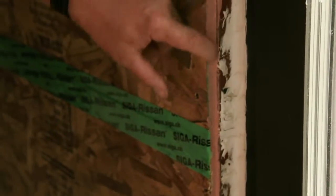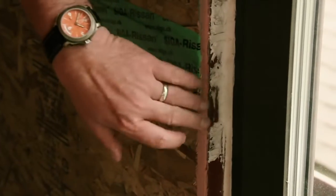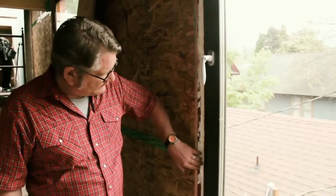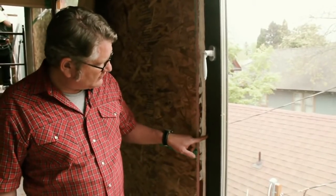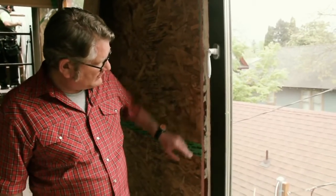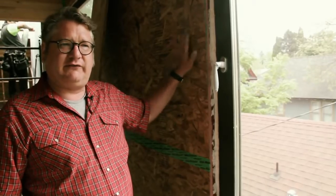The pink stuff spans a structural joint — for instance, the structural joint here between the OSB and the framing — and then the wet flash, which is this red stuff, goes out onto the building face and interfaces with the paper, which is a flexible product called Sure Flash. That is overlapped and glued to the framing so that the final component of this system is this air sealing caulk right here, which seals this window to the wet flash. That air seal is managed out through the pink stuff out to the OSB, and then this airtight layer is all protected by the assemblies built on the inboard side, so that over time it would be very difficult to get a pull through this airtight layer as it's sandwiched into the center of our assembly.